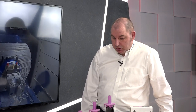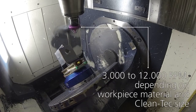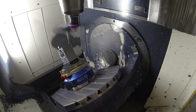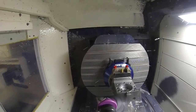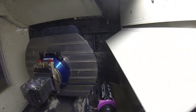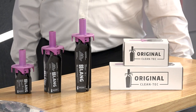Yes, Joe, we have a number of users that do that. We advise just creating a small macro program which you can then call up within your cycle or at the end of the cycle. So if you have through-coolant, you can come around and wash the swarf off first so you know it's going to be clear, then start the spindle — the blades will come out a bit like a helicopter blade — and then you just move around your machine and that'll blow your swarf and coolant off.